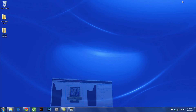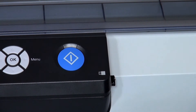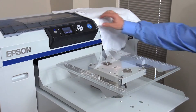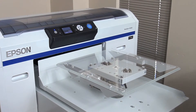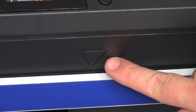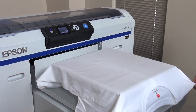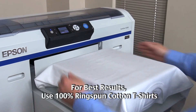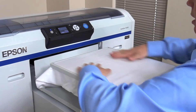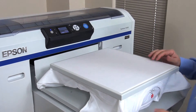When completed, eject the flash drive and bring it over to the printer. Insert the flash drive with the print file. Remove the platen frame and set it aside. Load your garment on the machine with the collar facing towards the operator. There are arrow indicators for the center of the platen. Place the shirt into the desired position, then replace the platen frame ensuring the shirt is flat and level and push it into position. This will draw the shirt slightly tight and provide a smooth flat surface for printing.